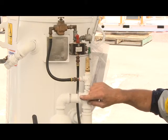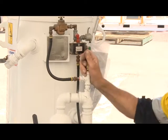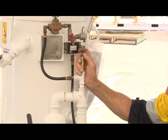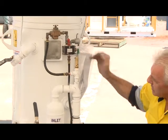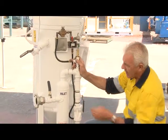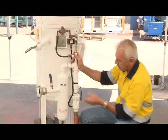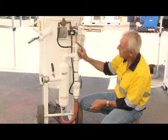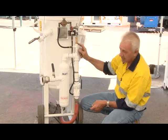So this valve will release excessive pressure. Say for example I'm putting 200 psi in this pot — this will automatically start to release pressure to indicate to you that there's a problem as far as the amount of excessive pressure that's been pushed into this pot. Paramount importance: keep them clean, don't play with them.